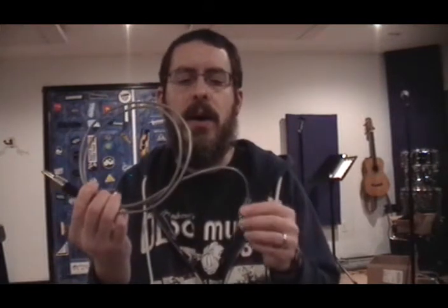Those shorted conductors connect to the tip of the mono plug. These cables are typically used when you want to connect your iPod, phone, or whatever to an input on your PA system or an amplifier, and you want to sum the left and right channels to mono. If you use a TRS to TRS plug you'd only be getting audio from one channel, and if it's a balanced input you won't get a proper connection since it's a stereo unbalanced signal going into a balanced input on pro audio equipment.